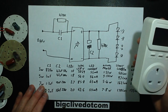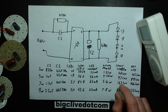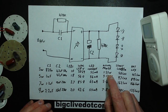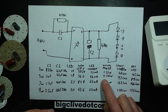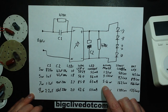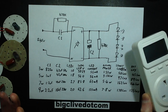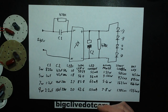Interestingly, having also used my basic power meter to test them, I found good agreement. The 3-watt measured 1.7W on the meter and came out 1.55W calculated — 0.15W accuracy, which is okay. The 5-watt measured actual power 3.136W, and came out 3.2W — within a tenth of a watt. The 7-watt came bang on 5.4W. The 9-watt measured real power 7.8W but the meter read 8.2W — only 0.4W out. This meter is surprisingly the most accurate I've ever come across for tests like this.